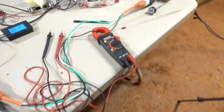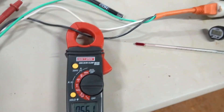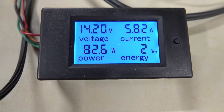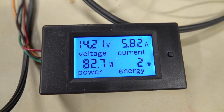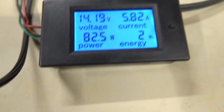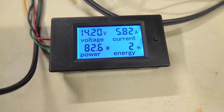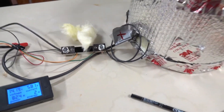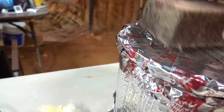Okay, it's 10 o'clock. We've got the DC clamp meter on the DC 40-amp scale — we're reading 5.6 amps. This device now has enough voltage on it; it won't work if the voltage is too low. We're measuring 14.2 volts, 5.8 amps on current, 82.7 watts. This symbol over here to the right is watt-hours — that's accumulating energy over time. I reset it at 10 o'clock since it now had enough voltage to operate. I checked the voltage directly on the element: it was 13.5 volts. We'll check the water temperature and see if there's been any difference.